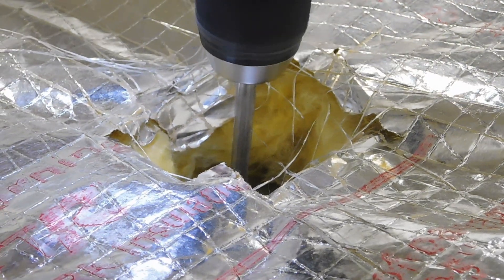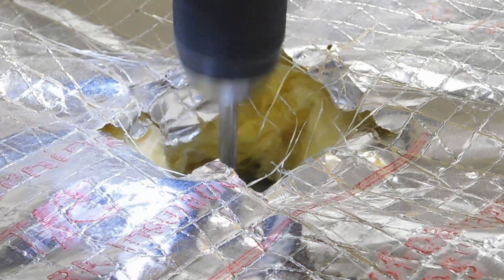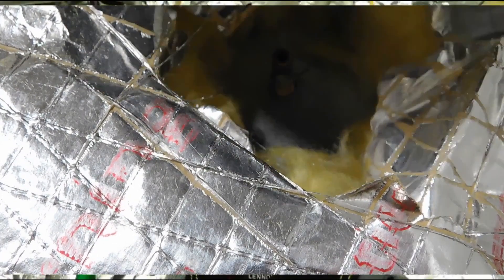Start by drilling your two 3/8 inch test holes with the metal piercing drill bit. If you are drilling into the unit housing, use a sheath to avoid damaging the coil. If there is insulation along the wall of the sheet metal, be sure your meter is able to go through the liner so you get a good reading once you have attached the brass bibs.